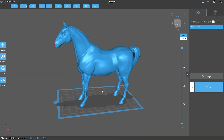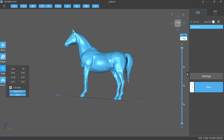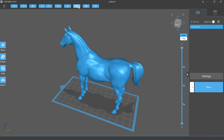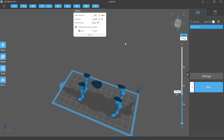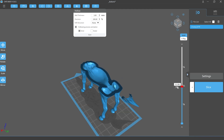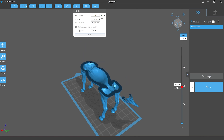This last model is a little more complex as it involves dealing with multiple cavities once we hollow it. The horse will be attached directly to the build plate and will require plenty of supports. I'll hollow with a three millimeter wall and no infill structure. As you can see there is not only a cavity in the main body but also inside the head, and these two cavities don't actually connect. I'll deal with the main body breathe holes first — the lowest point seems to be the chest, but there are also a couple of cups created at the top of the legs.